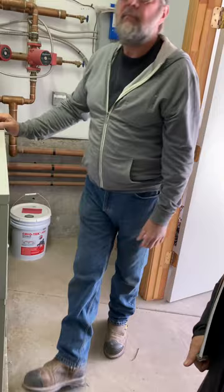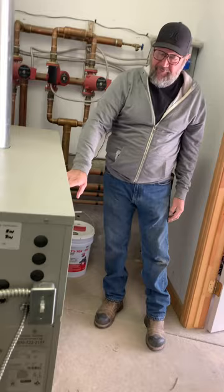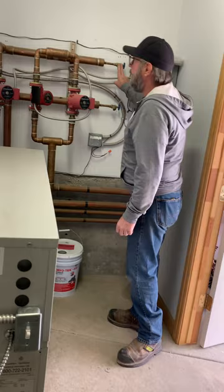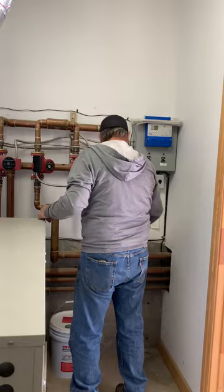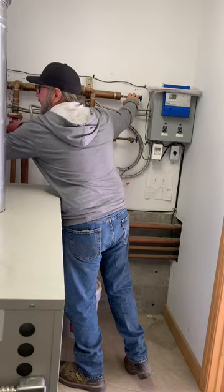So then within a year's time, less than a year's time, you've gone to this. I wonder if they got all the air out of it to begin with for you last year. Okay. Let's see what you've got for purge valves in here. That's good. One here, one here. So let's just look. You could force fluid in and isolate it. It would have to go out. They'd even drawn arrows for you, it has to come back and has to come out. So yeah, these two are the ones you'd purge from. You'd isolate the system here and purge it from there.